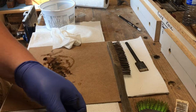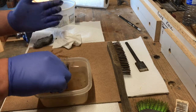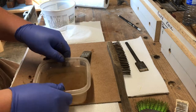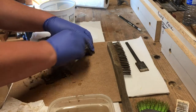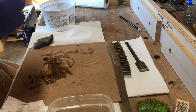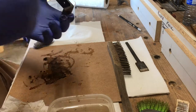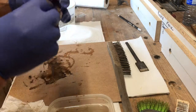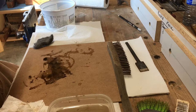I'm going to dunk this in water now — that's where it neutralizes the vinegar. I'm going to rinse off my hands again. I usually do this outside but for the purpose of this video I'm doing it inside, so I would recommend doing this operation outside. What will happen is everything I clean off right now will get a thin coating of rust on it again just from being in water. All you do is take some steel wool and oil after the fact and give it a little scrub down. That improved a lot — I'm really impressed. I'm excited to put that back on the plane.